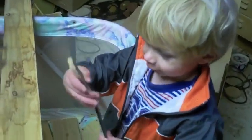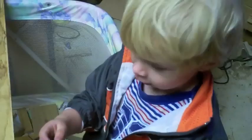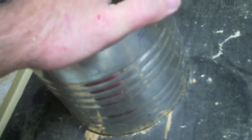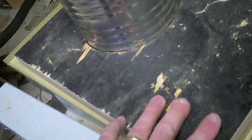Do we need some glue? The wood broke — right there. What we're going to do is glue this piece into there. I've got it just on a sheet of metal to protect the tabletop from the moisture. I've got some wax paper down inside. It's a nice tight fit. So I'm going to use the expanding polyurethane glue — I'll put a bead around this edge. As it expands, it'll lock in place. It'll grab on this lip, it'll grab with the plywood — the roughness, tightness, stickiness, glueiness — it'll hold her nice and firm. And that will become the bottom mounting point and the output chute of the dust collector.